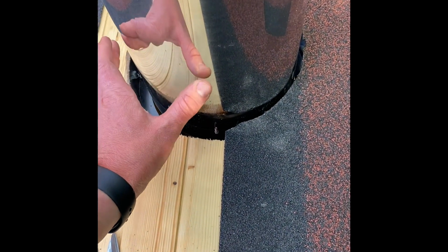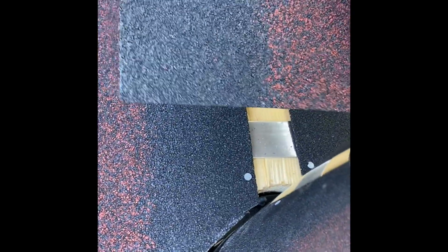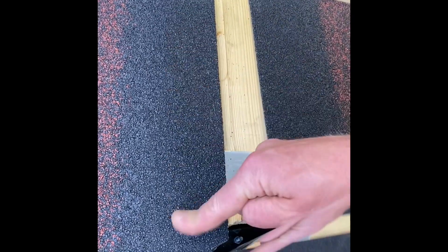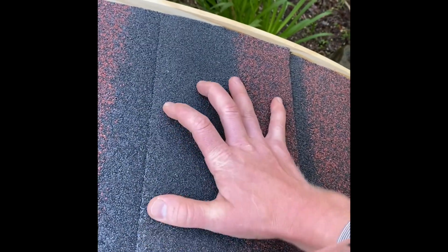After that, we'll get the flue chimney seal, the rubber seal, which will come over the top of the flue and down on the top of the shingles. So we'll put another 2 layers, and now we've pre-cut this rectangular section for this side of the flue. We will be applying a silicone adhesive on this side and another bead on this side, and then we just put this rectangular sheet over and put something heavy on it for a little while so that it sticks, and that's it. This should create a good weatherproof seal. And the same thing we're going to be doing on this side.